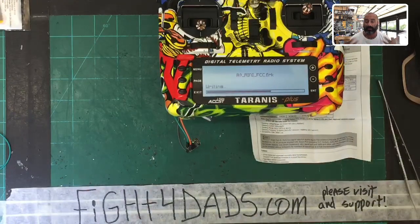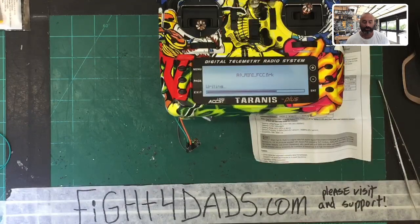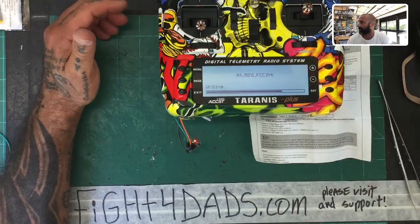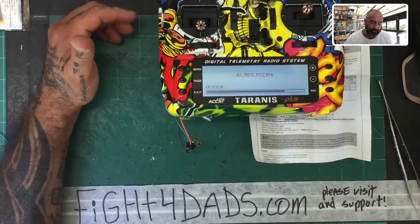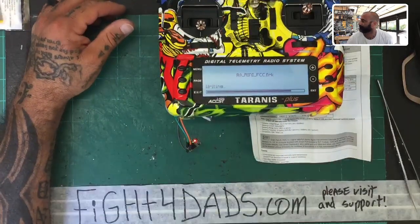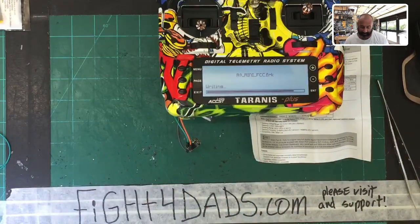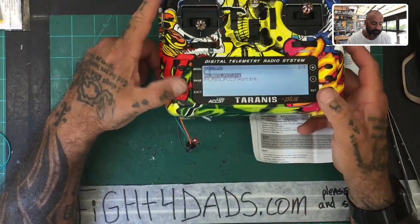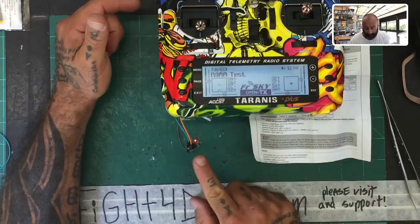You do end up with little hiccups like this where the receiver will actually power on without you writing to it. The QX7 did not do that in the last video. So make sure to use caution — have your pins in first, then turn the radio on, and turn it off before you remove your pins again so you don't accidentally short anything. We're waiting for this to finish writing. This R9 mini has been flashed a ton now since it was used in both videos, but it worked out well.